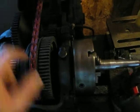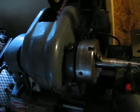My back pulley does not vibrate as much as it used to. Something I've learned is this is actually a special pulley for wood cutting — so this is the faster of the two speeds, and this is the metal cutting mode. I've heard that a carbide bit — this is a Harbor Freight carbide bit which is holding up quite well — should be faster than high speed steel. So this is the slowest speed of the wood cutting speed, which I don't even know what that RPM actually is — I have no way to accurately measure.